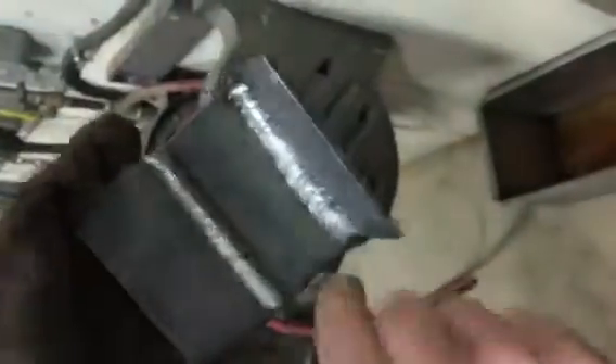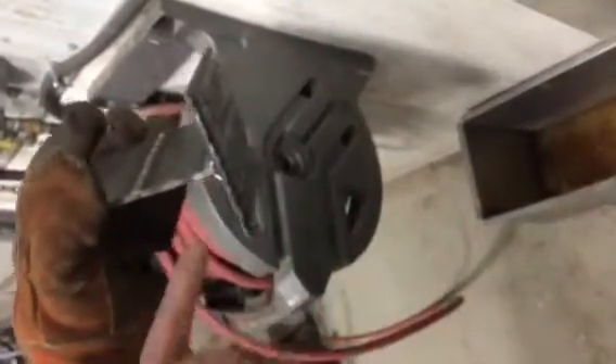So now we got our butt weld here and we have our T-weld. That kept it straight because we put those two tacks on there, so that kept it nice and square. We have your plasma cut here that I can grade. And then on this side, we have your entire pad that you built. So you can hit this with a grinder or a wire wheel and clean that up a little bit. That's the project we want turned in when we're done.